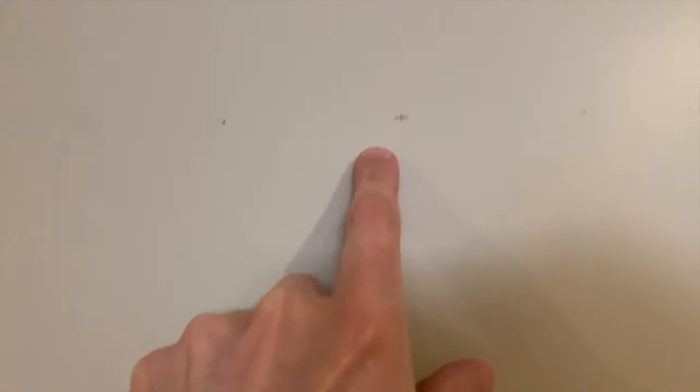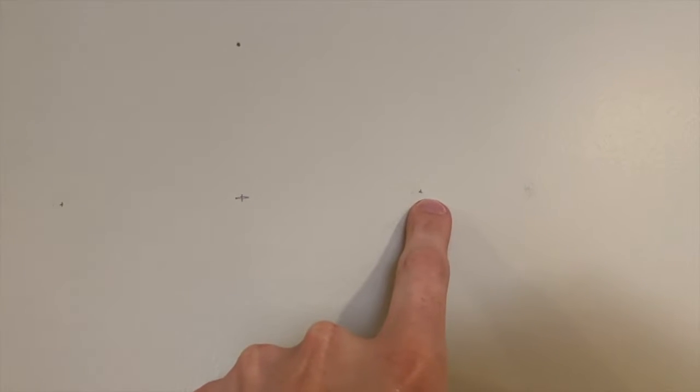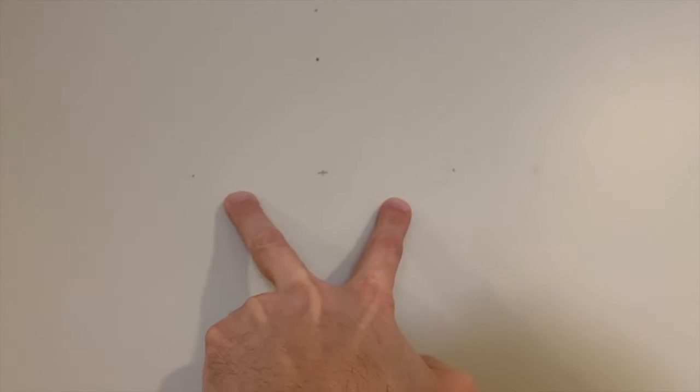And then I measured from the center point out to each opening, and that was exactly 3 inches. So 3 inches to the left, made my marking. 3 inches to the right, made my marking. And then I placed a yardstick right here and put the level on top to verify it was perfectly level. And those are the top drill points or anchor points.